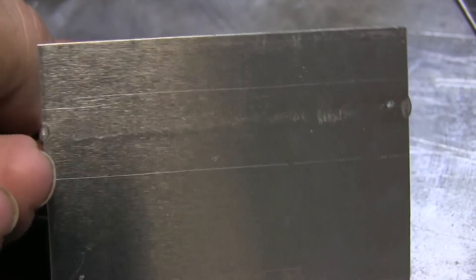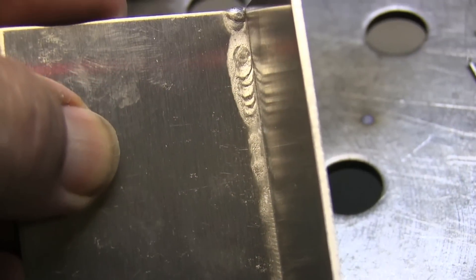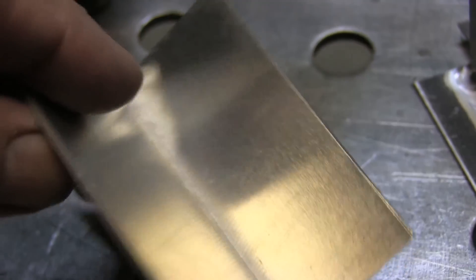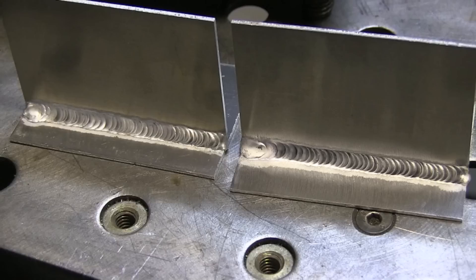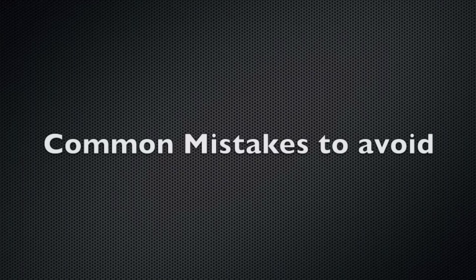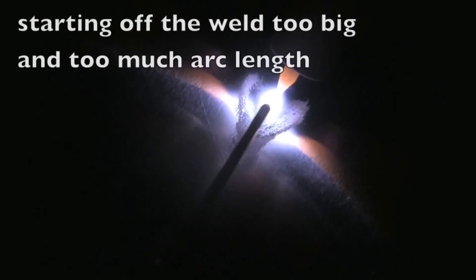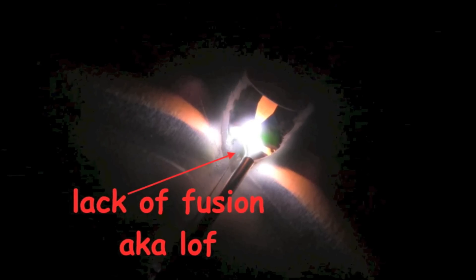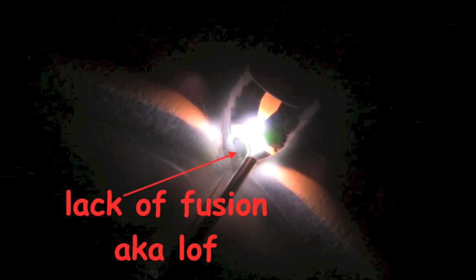I'll show you an example of suck back — something that might fail a joint like this. So far this would be okay, but that probably wouldn't — see, that's reducing the thickness there a little bit. There's a lot of different interpretation of this welding code, but most likely that melt back right there would fail. Those were a couple of joints, and the thing is you're not going for looks on this — you're going for penetration but not excessive melt back, so the joint won't look as good as it would normally. Now let's look at some how-not-to-weld arc shots. A common mistake is starting the bead off too big — you're already tunneling. You can see it's wetting into the sides but there's a void, a notch at the front of the puddle. I haven't pushed it down in there, I've got a big weld, and there's obvious lack of fusion. There's also a little pour down on the bottom toe — that's not what you want to see.